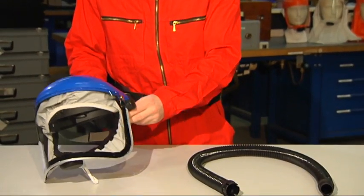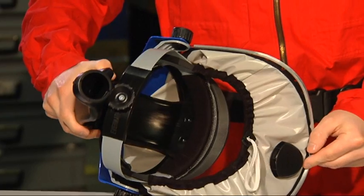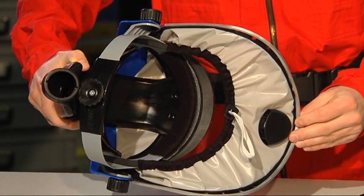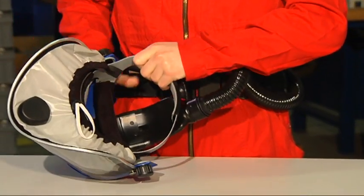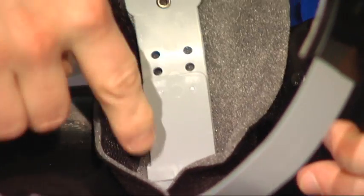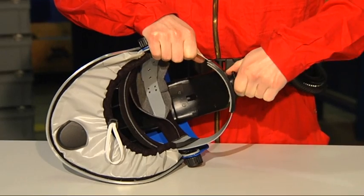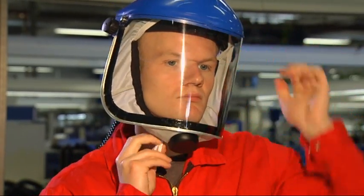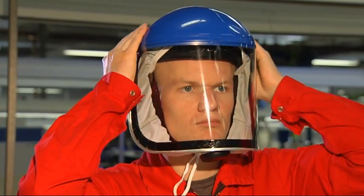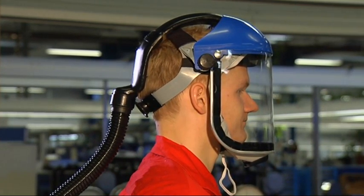The lightweight protective face shield in the Draeger Explore series is a unique combination of respiratory protection and eye protection. The direct air path into the respiratory area creates special wearing comfort and prevents the visor from fogging. A greater chemical resistance is offered by the version with an acetate visor. Together with the TH2 hose, this combination protects you up to 20 times the limit value of a substance. The visor can be individually adjusted for head size: undo the top Velcro strap to adjust the head height and adjust the knob at the back of the head for head width. After donning and adjusting the face seal, the position can be re-adjusted if necessary. A peel-off visor can also be used with this visor for protection against scratches.